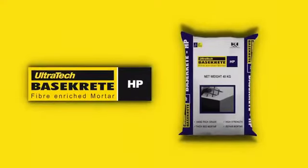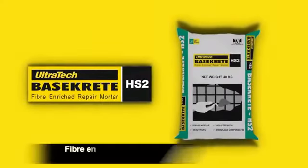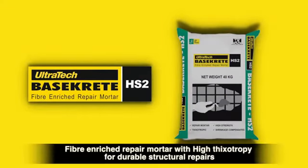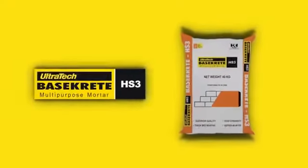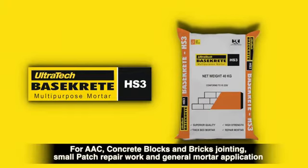Basekrete HP, fiber-enriched high-strength repair mortar for overhead slabs and beam area repair with hand-packed profiling. Basekrete HS2, fiber-enriched repair mortar with high thixotropy for durable structural repairs. Basekrete HS3, for AAC, concrete blocks and bricks jointing, small patch repair work and general mortar application.